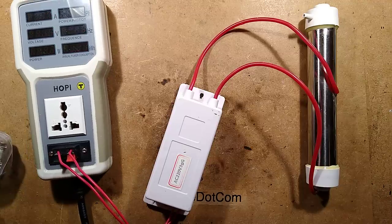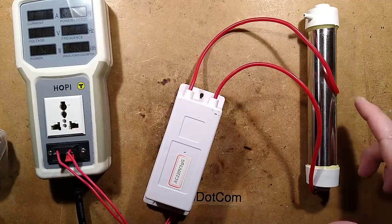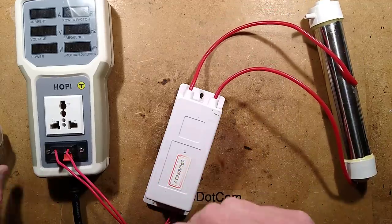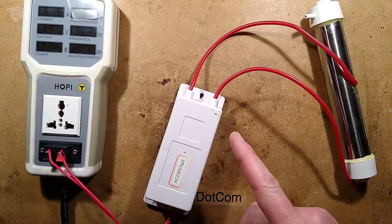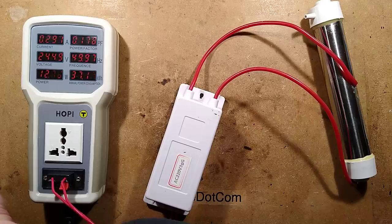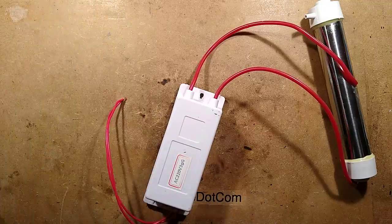That's more arcier than I was expecting. Is this going to be safe to touch? Yes, because I already measured the resistance across that — it was about 600 ohms. It's not showing any heat. Let me remind myself what the wattage was. I said about 16 watts — hold on, I'm going to do it again. 12 watts. Power factor is terrible. 290 milliamps.